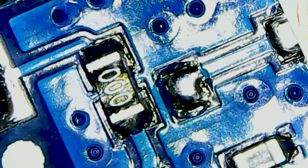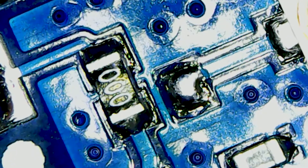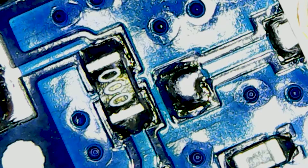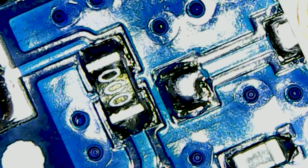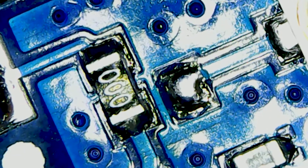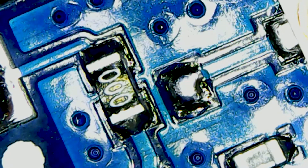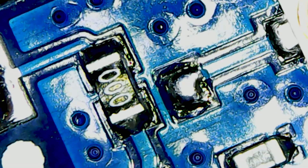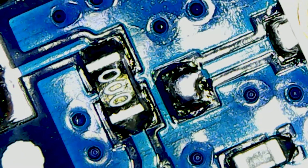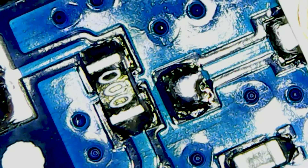The technique we're going to do today is basically attempting to use a bit of hot air to heat this up until it's ready to release the component. We're going to take it off of the board and then attempt to remount it. The way we remount it is by heating up the solder again and placing the component while holding it in place with a pair of tweezers. This is pretty delicate work. I'm going to blow some hot air — pay attention to when the solder actually becomes liquid, because that's the point at which we'll be able to move the component. First I'll heat up the board a little bit in general, and then you'll notice the flux will start to go a bit, and then if I'm accurate with the heat gun — you can see right there — the solder just melted.